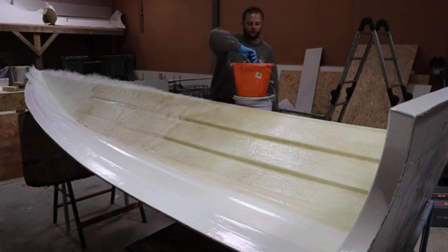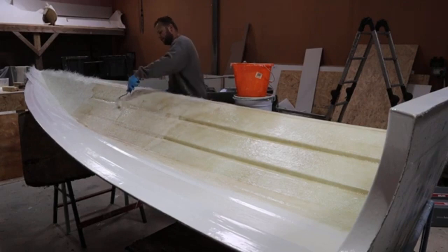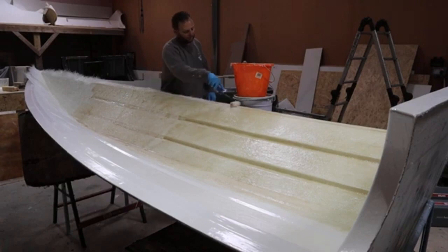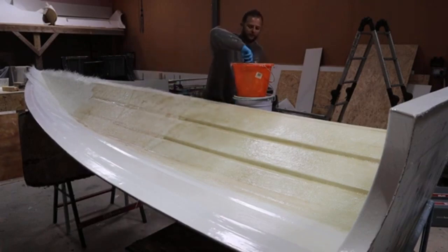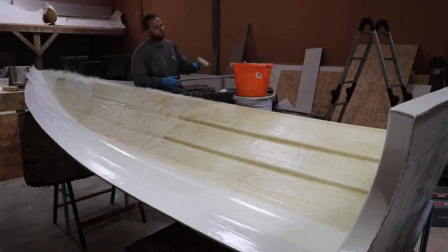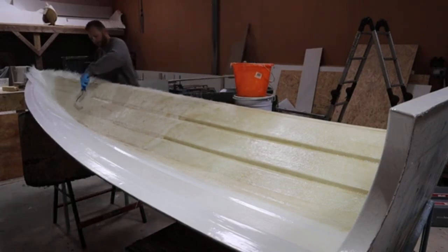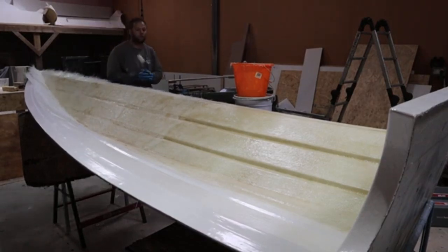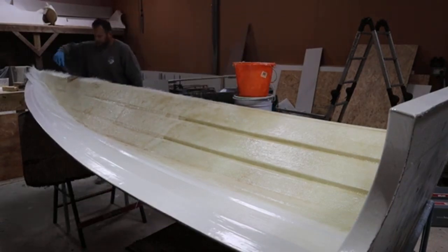Under MCA guidelines, the commercial guidelines for building boats and fishing vessels and coded work boats and RIBs and all this sort of thing, it is an expected obvious. The isophthalic first layer is, especially on the hull, just because of the amount of time that's going to be in the water. So, save yourself some pennies. If you're going to build something yourself, whether it be a seat box or modify your boat, then probably the best bet for you is just polyester resin.